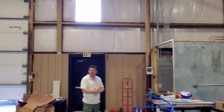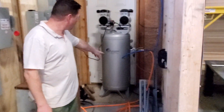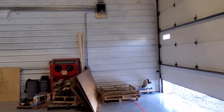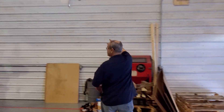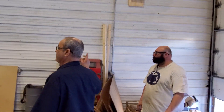And the scissor lift is here for Monday because Monday we're going to run the air up and over to the other wall. If you come into the closet here, this is the beginning of the run — right now it's still hooked up to the temporary orange air hose, but Monday we're going to tie into the main half-inch line, come up to that T, over, and down that wall. We're going to run the airline up above the door, down, and across to these two machines with a drop, then to the two milling machines — three drops on this side as well.